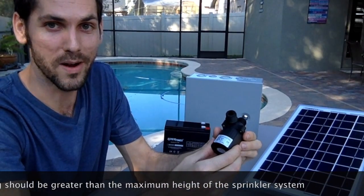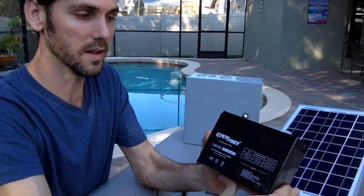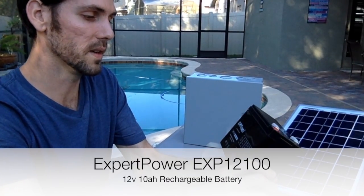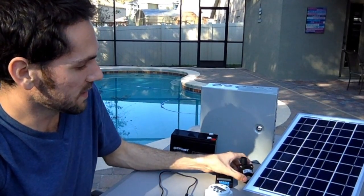Unless you buy a really good pump that can run directly off a solar panel, you'll need a battery to provide stable power to the pump. This is a 12 volt, 10 amp hour battery. I tried not to go overboard on parts — I tried getting the smallest parts possible for what I need. I chose the 10 amp hour battery because an amp hour means it can provide X amount of amps for an hour. So 10 amp hours means it will provide 10 amps for an hour. Since this pump only takes 1 amp, it will run the pump for about 10 hours before the battery is exhausted. So if I have a day or two with no sunlight, I should be in good shape.